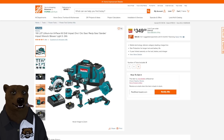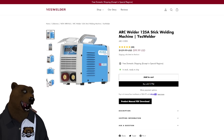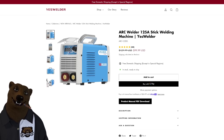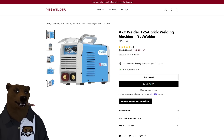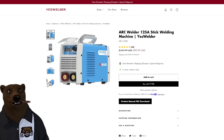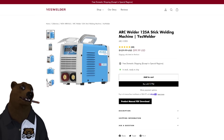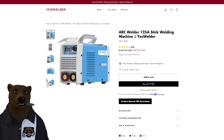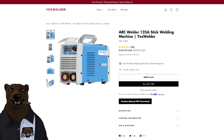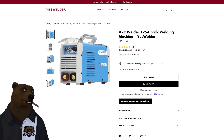Yes Welder has one of the least expensive good quality basic stick welders out there. Stick welders are great — they'll weld on dirty or corroded metal, popular with farmers and ranchers, and with their low voltage draw you can run one off a small gas generator out in the field. Do not weld indoors without amazing ventilation. It's $100, but Yes Welder is a friend of the channel and gave me a discount code — 'den of tools' — for 10% off, bringing it down to $90 for a 125-amp stick welder.